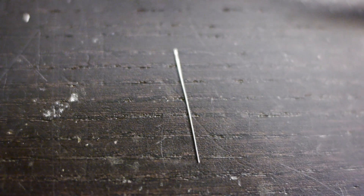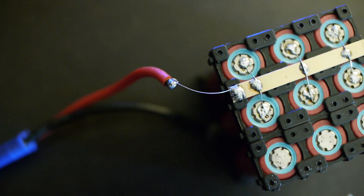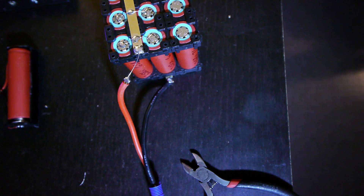I have some tiny wire I have laying around. I built this 9-cell module to see how it could be used to connect bus bars to each cell. This thing right now is going to see 4.4 amps, so it's not supposed to blow — it's supposed to withstand it. Let's try it. The current ramps up through 1.7, 2.8, 4, 4.3, 4.4, 4.5 amps — and it holds. It can withstand the maximum amount of current I'm going to ask to go through it. I already did a test and it lasted more than 5 minutes, and I'm never going to ask for more than 30 seconds at max.